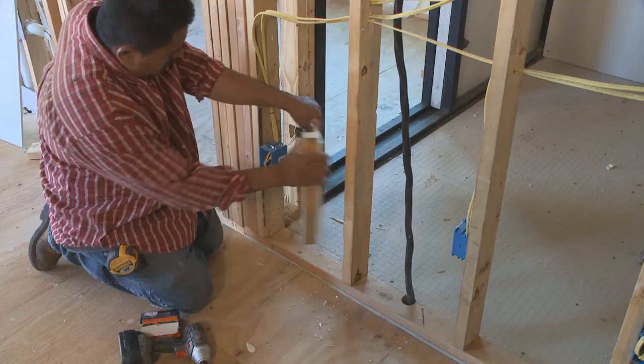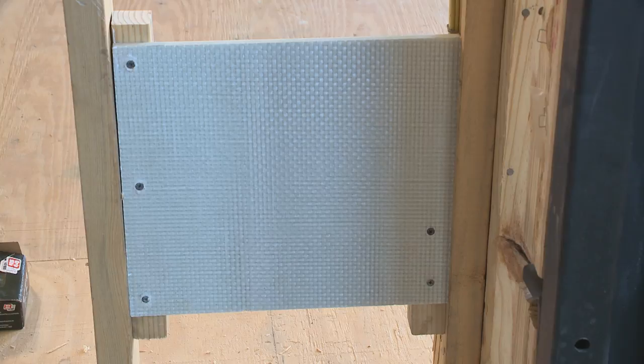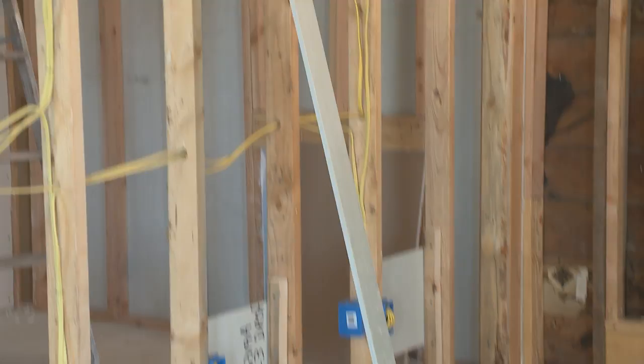In order to provide protection behind the penetrations, a 12 inch by stud length piece of the same level of material is placed at the backside of the cutout. Another potentially vulnerable location is the butt joint where the two panels meet. A 4 inch batten strip of the same level of material is attached to the back of the panels at this joint to provide backing protection.